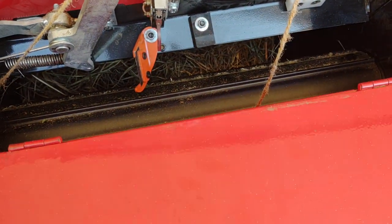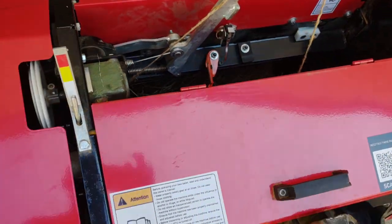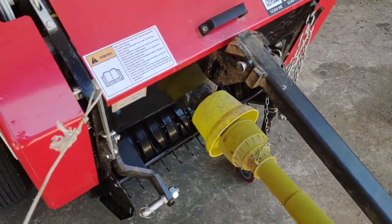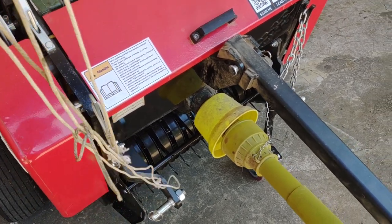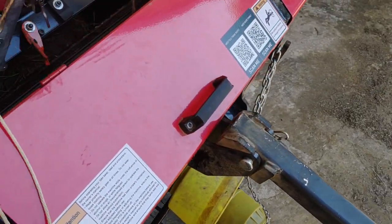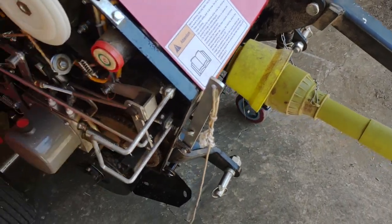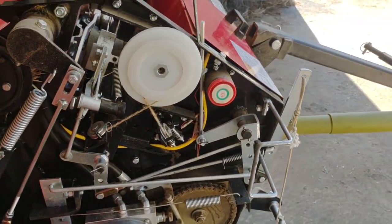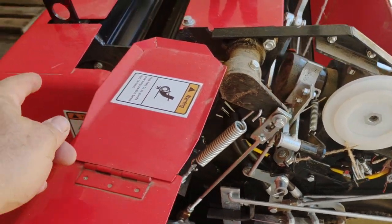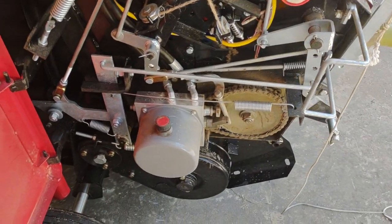This is the battery compartment for the bale-full alarm. You can hear it when that arm drops and makes that racket. We have the manual bale release, so when you're on the tractor and that arm drops, it'll tie that off, and once it cuts the string, this is its neutral position. Then you pull this and it activates the hydraulics back here, which raises the gate and kicks the bale out.